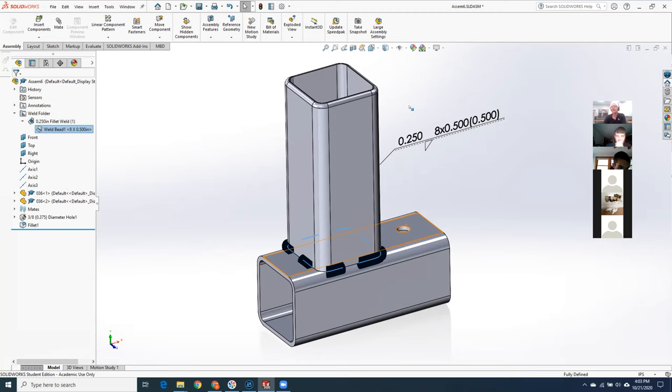Once again, what type of welding do we need to do on the parts of the tractor thing? So you're just going to do a simple fillet weld. You'll do a 1/4-inch bead on the edges that I've specified. Okay, thank you. And for the top weld, what should the spacing be again? For the intermittent one? Yes. 3 inches of weld, 3 inches of space.